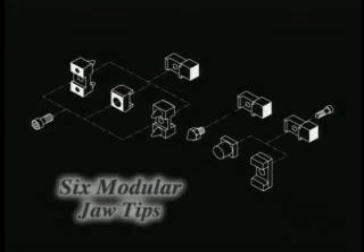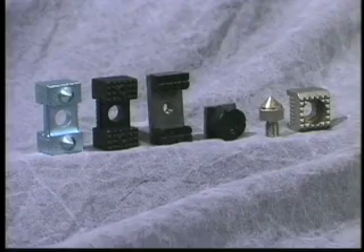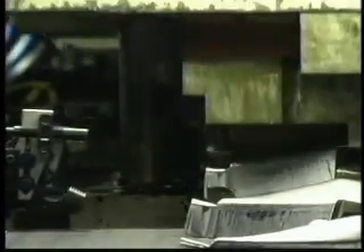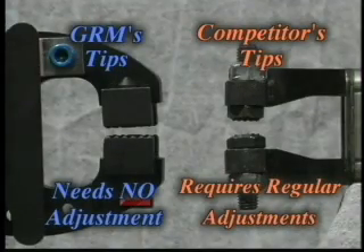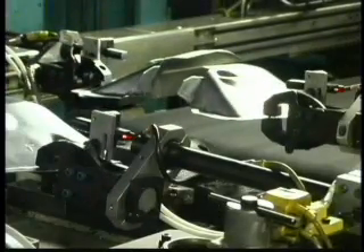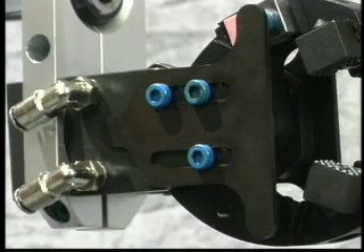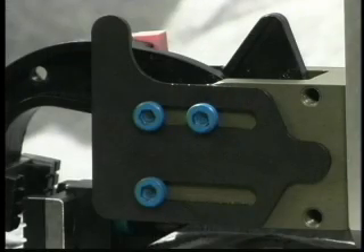To increase the performance and customer satisfaction of the GRM clamps, PHD offers 6 different modular jaw tips which are color coded for quick, easy verification of proper setup to various sheet metal thicknesses. As well, you'll not have to regularly adjust these jaw tips as with other clamps because PHD integrates locking threads in the jaws, keeping the tips in position and the clamp in locking range at all times. Two adjustable hardened steel impact plates are also included with the Series GRM clamps, protecting the jaws and body from extreme panel impact.